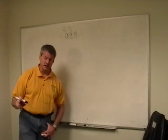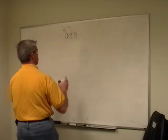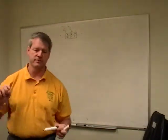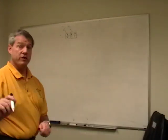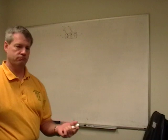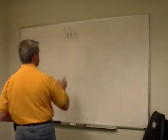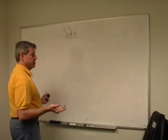This happens thermally. The thermal excitation of the electrons creating this diffusion region is the reason why a silicon diode has about a 0.7 volt voltage drop to turn it on. If you get them really, really cold, like 100 Kelvin or so, it goes down, because this comes closer together because there's fewer electron hole pairs being generated.